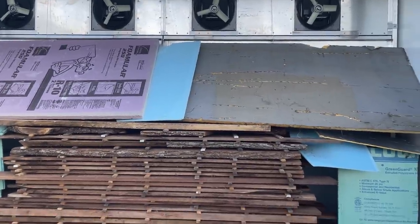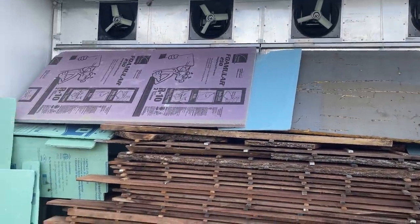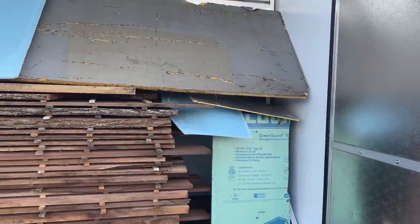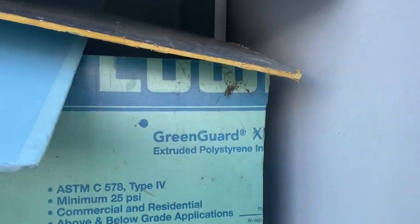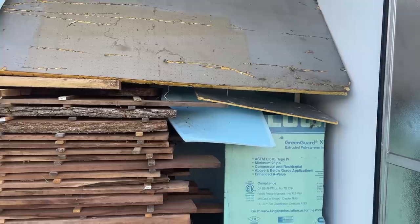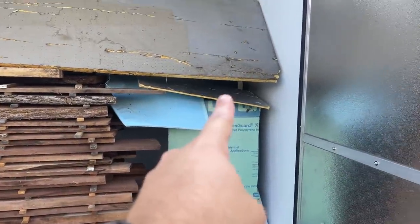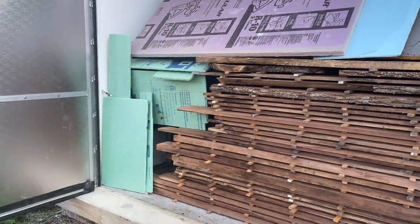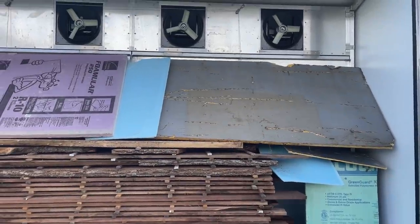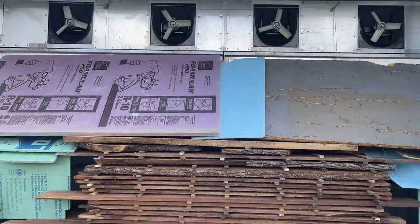Good deal — got her baffled up right there. That's all you need right there, guys. I've got some 2-inch rigid foam on there and some half-inch extruded polystyrene — I never can pronounce that stuff. Right there is the name. Those are the baffles we use, just off cuts. I'll probably run up to the other kiln sometime today and get a few smaller pieces to fill in that gap. But that's how you baffle a kiln — you want to make sure all the air flow comes from that fan down into your stack.